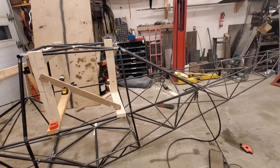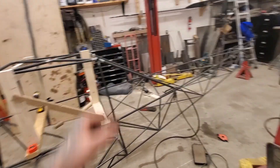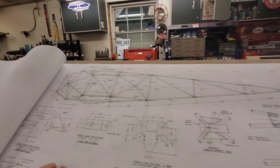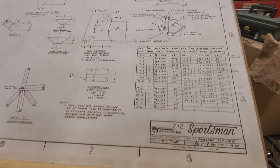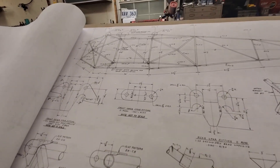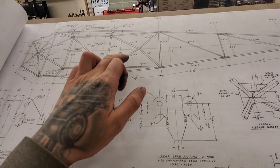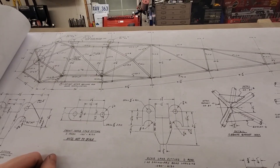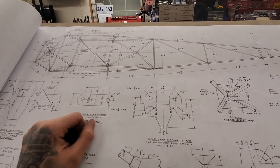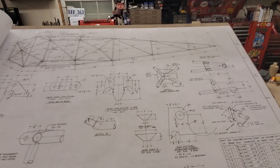She's in place. I got the back two tubes put in, so now it's just to put the cathedral — the X-brace — in and all the front tubes, which are the ones labeled UF: UF one, two, three, four, five, six. There's some tubes that are a pair, like this one and this one here — they're US13 — and then for some reason they'll have these ones as US6 and US7. They're all the same measurements. There's a lot of funny things with these plans.